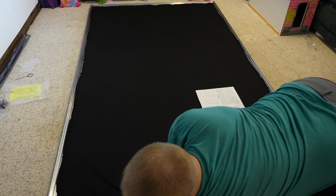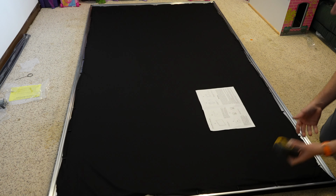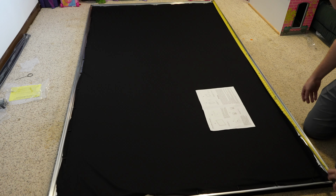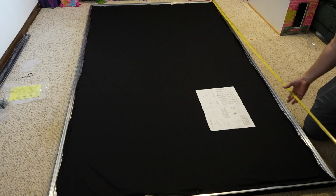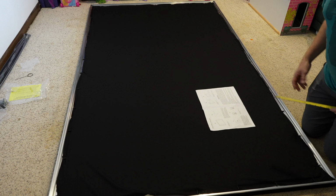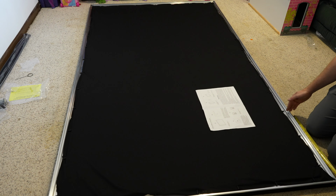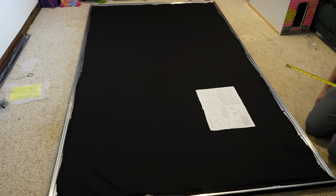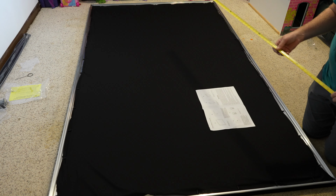Now what they tell you to do is actually take your tape measure, measure the full length. In this case, 98.5, call it. And I want to be -40, and that's with the bracket spacing apart. So that puts us in about 20 inches from the edge. More than anything, we're going to want to be on a stud. So if I was to go by the -40 inches rather than 98.5, the spacing between is 58.5, right?